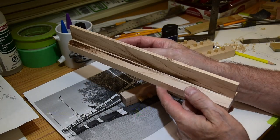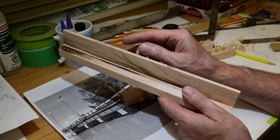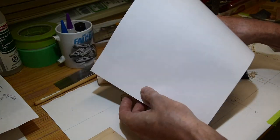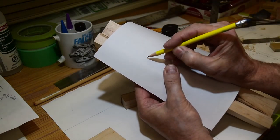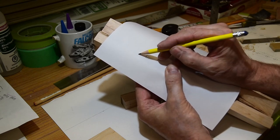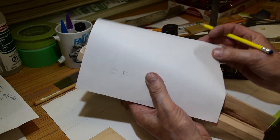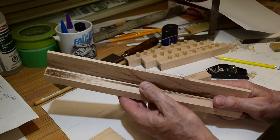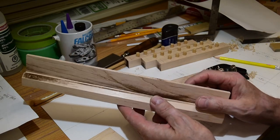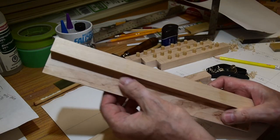It's a glue joint rip blade. Glue joint meaning it has a little round tooth, like the tooth on the glue joint. It's kind of interesting. Instead of being a wedge shape like that, it's actually sort of rounded on the top. And so it's just for ripping. I know it's troublesome to change the saw blade on your saw, but you have to if you want nice, clean cuts. This is so smooth. I haven't even sanded this.